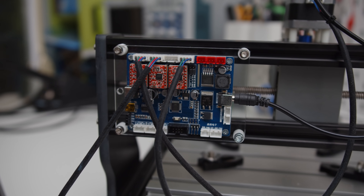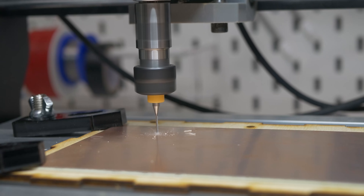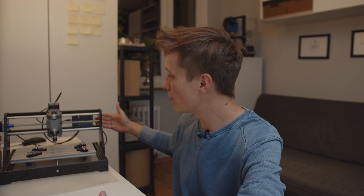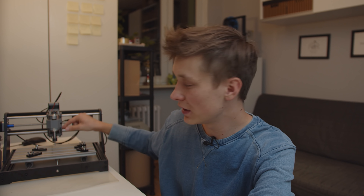Hello and welcome to the CNC test — the $200 CNC machine. It's a CNC machine made out of aluminum profiles, some steel linear rails, trapezoidal leadscrews, stepper motors, a control board, and a spindle. The spindle is a DC motor powered with 24V and has a nice ER11 collet so you can attach any milling bit up to 11mm. Only one collet for a 1/8-inch (3.175mm) milling bit is included in the kit.